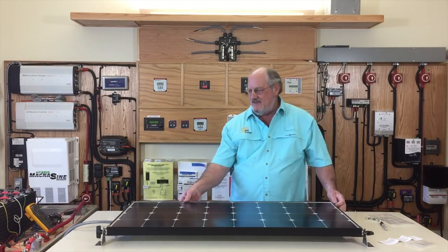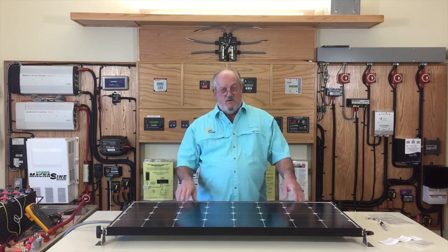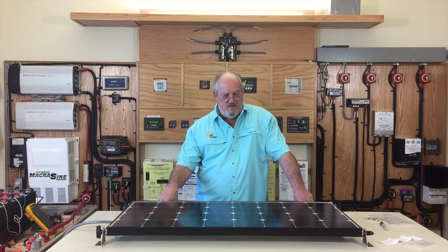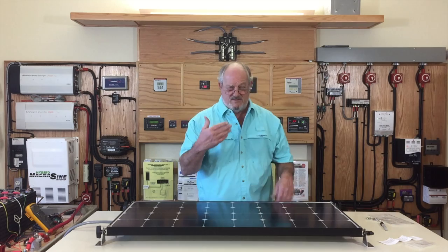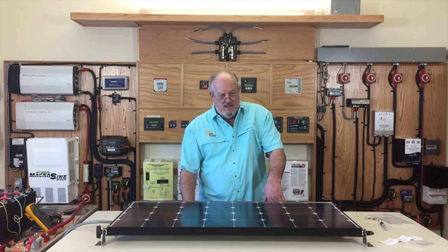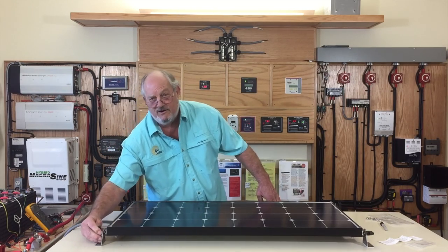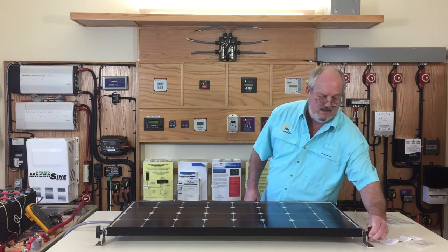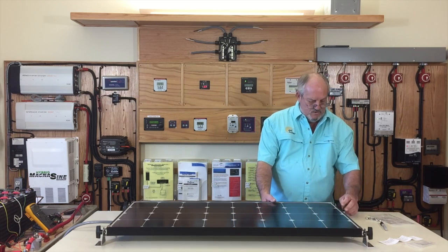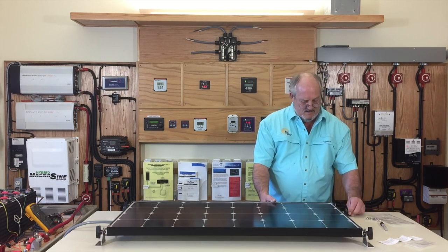Now that we're all stuck down to the roof, I want to show you how to tilt these panels, because tilting in the winter makes a whole lot of sense. You can increase your output 30, sometimes 40 percent by just tipping the panel up. So we're going to loosen these about a turn so that the panel will move freely on the hinges, then completely remove the knob on this side on both ends.